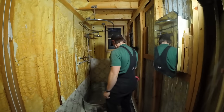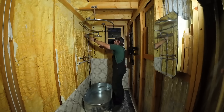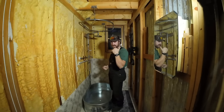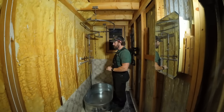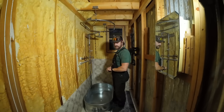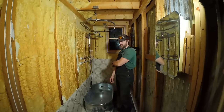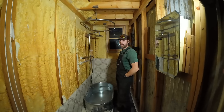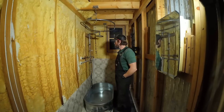Got the hot water heater working, fixed the leaks, did a little repiping outside. After testing it out on the sink, it seems to be really hot. The temperature setting is kind of ridiculous, like you could boil water with the darn thing. So I may have to add a cold water mix to this. I have a second valve for cold water to mix it in there.